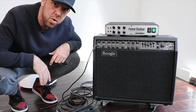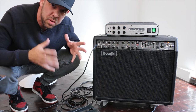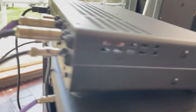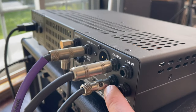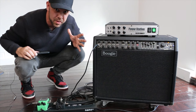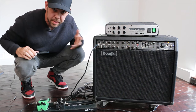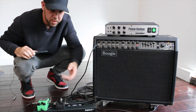Now I'm down on the floor with a slightly different rig. We're using the Mesa Mark 4 because I wanted to demonstrate what happens when you use a gainier amplifier — that's where this issue crops up more often. The signal path: guitar into the Tube Screamer, then into the front end of the Mark 4. Around back, we come out of the effects send of the Power Station into the Slate input, then out of the Slate's output back to the effects return of the Power Station. We're purposefully inducing this — it won't hurt your gear, just be obnoxious — but we need to know what to do when this happens. Here's what it sounds like when the ground of the pedal in front of the amp touches the ground of the pedal in the effects loop.